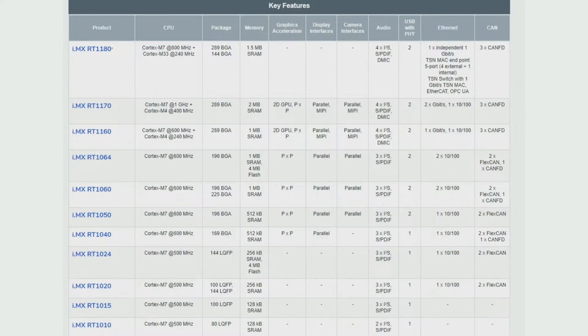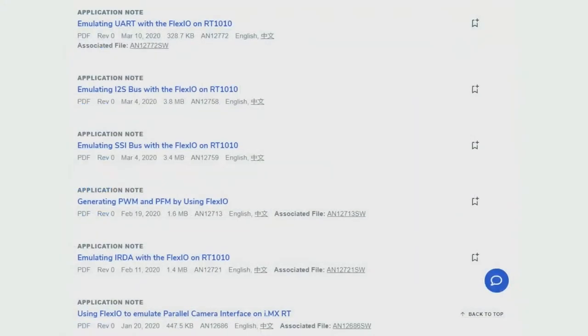The full table is on the NXP website. As you work up the 1040, if you want a camera interface or USB host plus USB peripheral — two USB ports — you bump up to the 1050. Keep going to the 1060, all the way up to the 1180, which is quite a beast with one or two megabytes of built-in SRAM. FlexIO is the most interesting feature — you can emulate a lot of peripheral buses. Maybe your pins are used by a parallel TFT or you need more UARTs; you can use FlexIO to mimic those. Note that it applies to the entire IMX series, and the 1040 has two FlexIO peripherals.